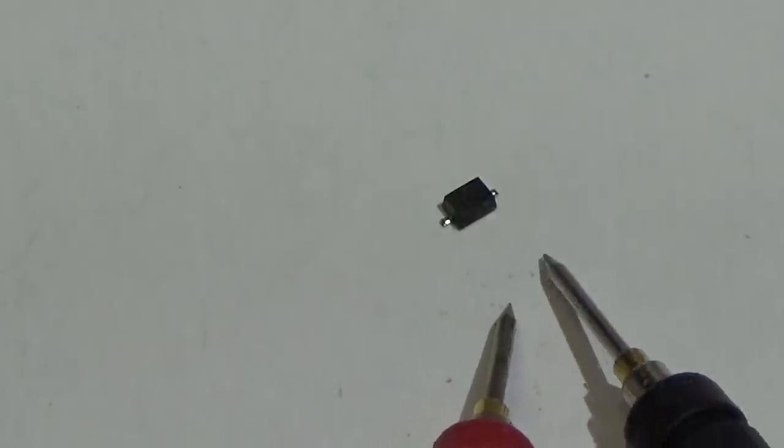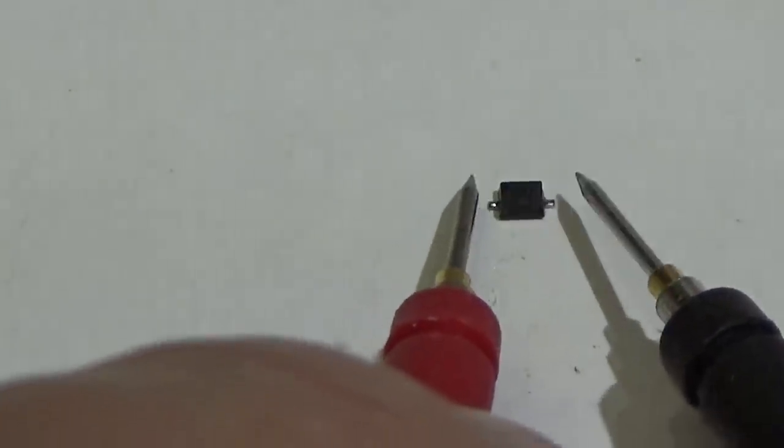Yeah, so that is a diode test mode. And diode test mode is giving us a short, for sure. One direction, turn it around and do the other direction, and it is definitely giving us a short. So this little diode is dead. So that is telling us that the Zener diode definitely tried to protect the radio from high voltages.